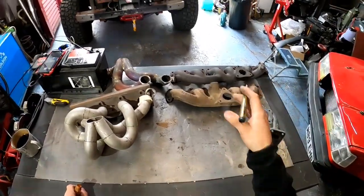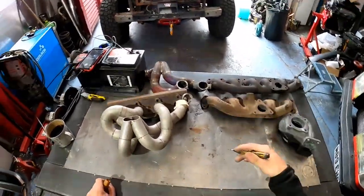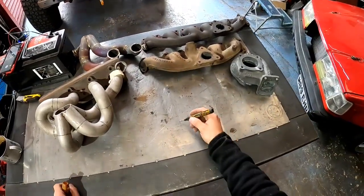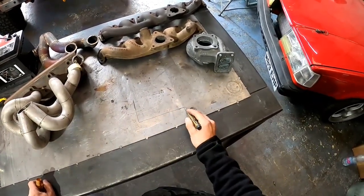Before, he was on an American log style exhaust manifold and a poor plenum on an M3 engine with a turbo. Then we did the exhaust manifold, the plenum and all the turbo system, and it was making the same kind of power but a completely different dyno graph. Let's say this is your graph, okay? This is the power amount and this is your RPM.